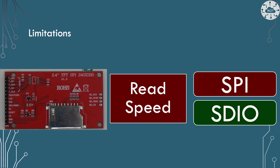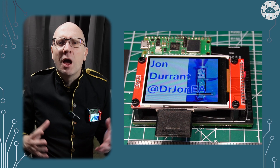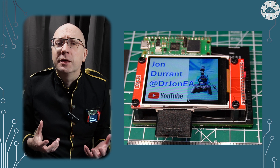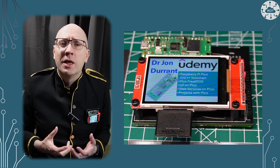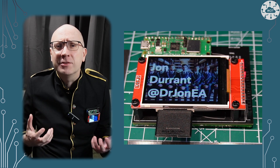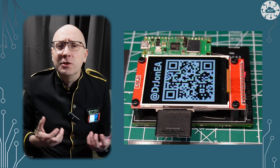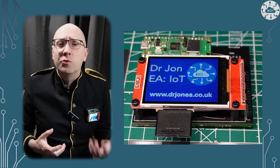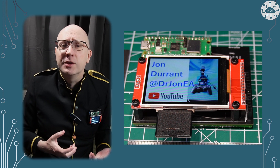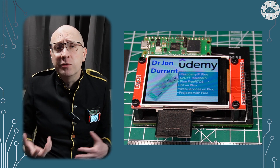That's a bit of a limitation — I would have to redesign an adapter and the board to handle SDIO, but it's certainly one way of speeding this up and might get us to a point where we can do animations. Over a few videos I've shown the functionality and connectivity for this TFT display. For a 2.4 inch display that cost me less than 8 pounds, this is really quite functional. I'm a little disappointed I could not play full screen animations, but a move to SDIO would possibly resolve that and may also solve the issue with large cards not being recognised — the bones of a new project perhaps.